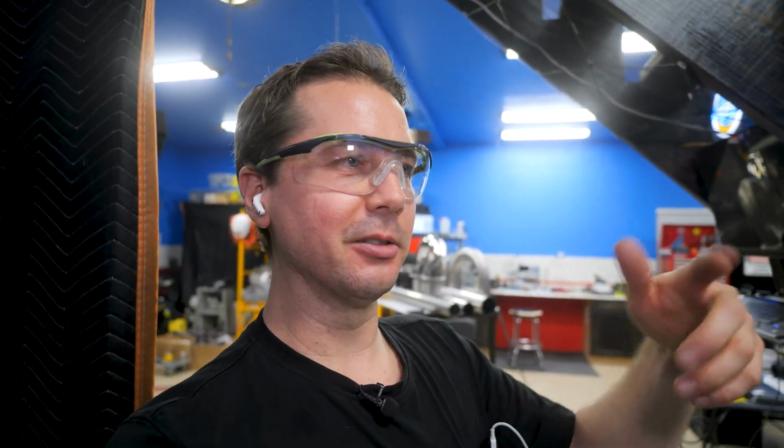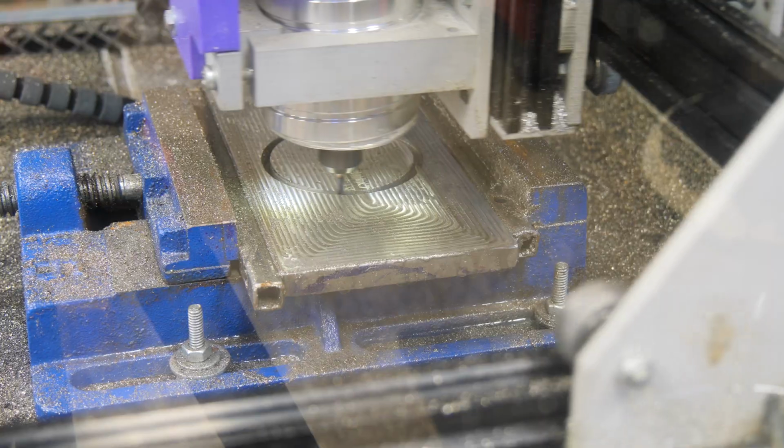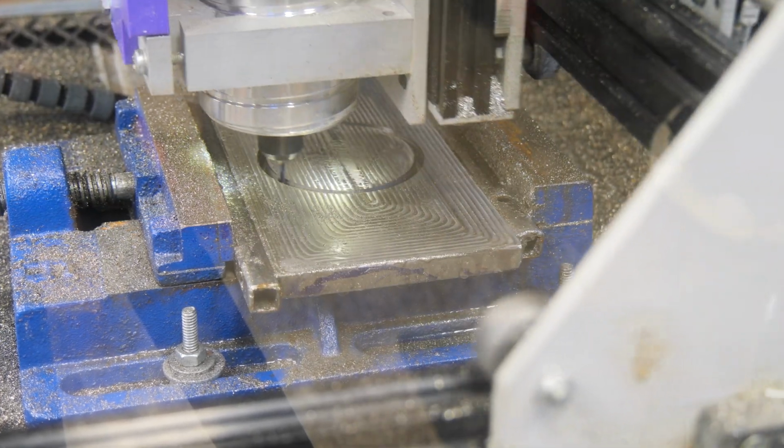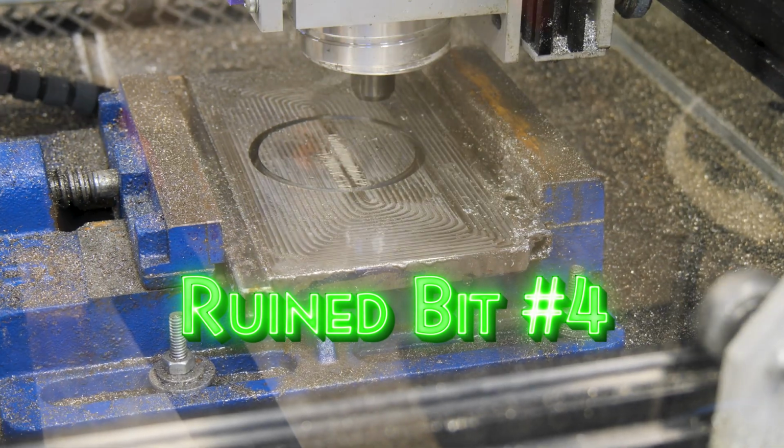Okay, this might be the magic ticket. So we're 1/4 inch way through this thing so far. We're doing 15 inches per minute, but only 5/1000ths step down. So it's taken forever to cut through, but it's been running for about 30 minutes. Seems to be doing okay, so fingers crossed. I wish I cared less, but I'm afraid we were so close.